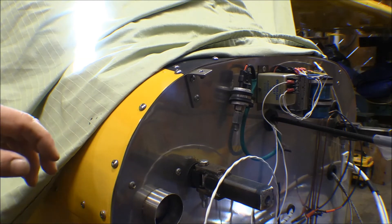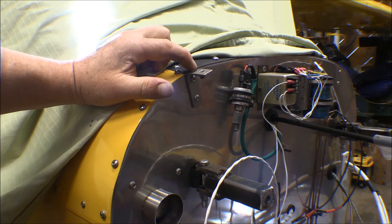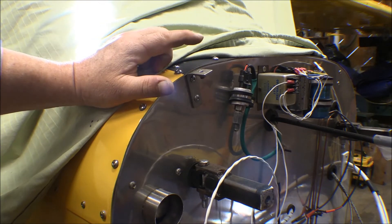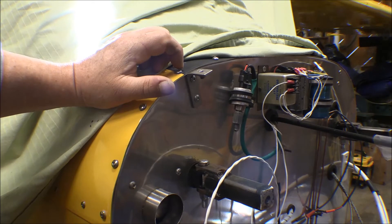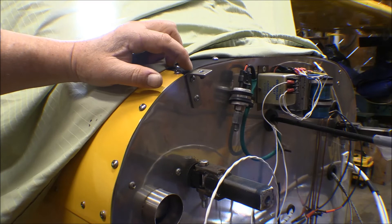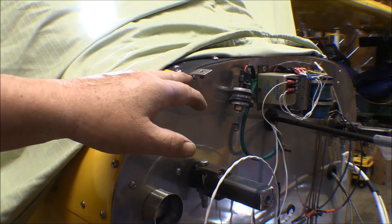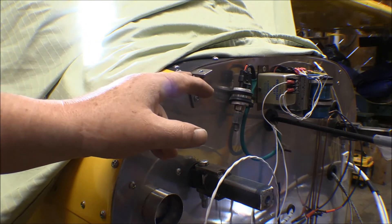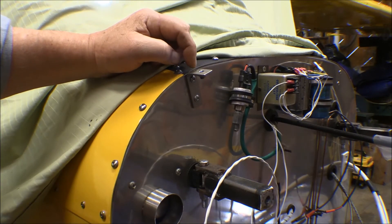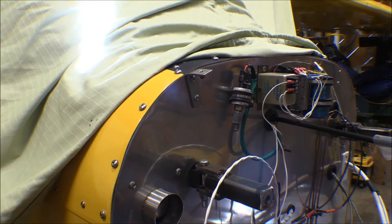My first bracket has been reproduced and installed — it's finished, mounts up there just perfect. I think it actually looks better than the original one that was on here, which I don't think is a Piper part. I'll go ahead and take the screws out of the left side there and measure those out — they should be the same thing. The bottom ones are a little bit different than the top ones. These top ones protrude up a little bit above the boot cowl, so they've got a kind of double bend in them. The bottom ones just have a single bend and they're bent past 90 degrees. The top ones have a first bend that's not quite 90 degrees, and then the second bend makes up the difference.